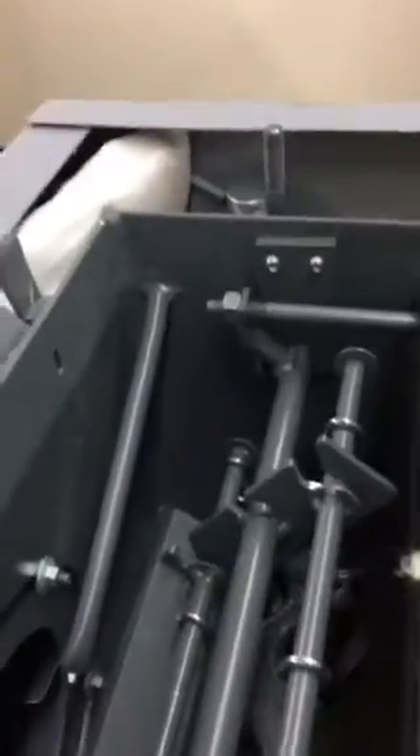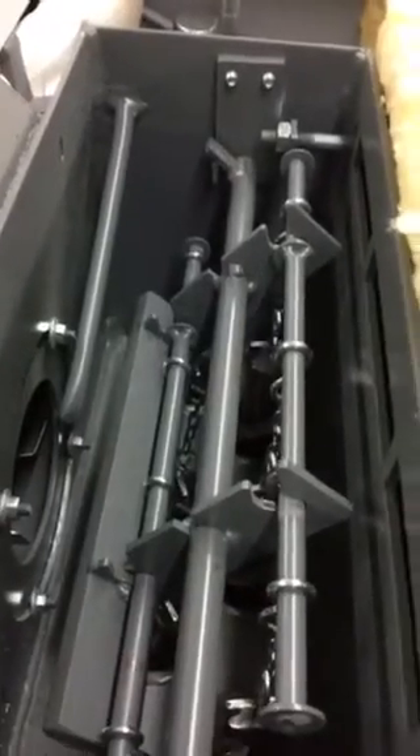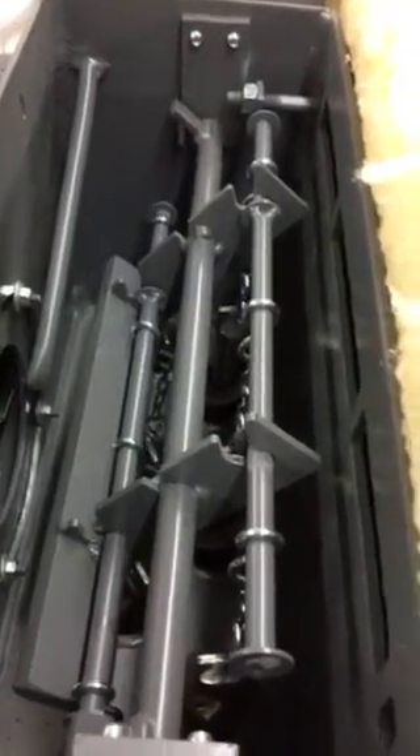When I open the door, you might have heard a clang. That's because this door is connected by a rod right here that goes to the back of the boiler. Every time I open and close this door, this rod lifts the heat exchange cleaners and then drops them. That scraping and percussive force during the drop helps clean those tubes off so that you don't have to brush them very often.